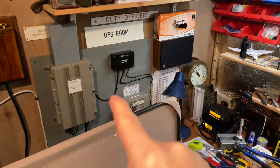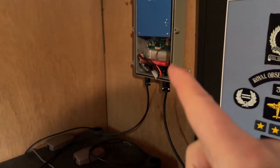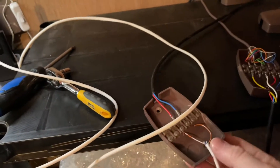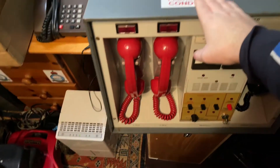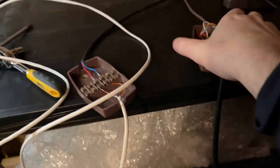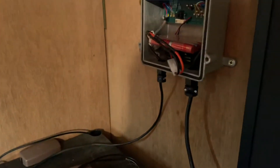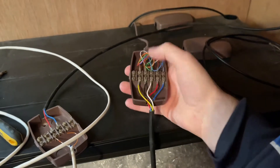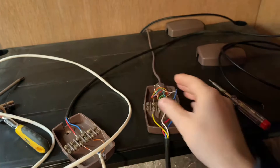What I've done today is put it on a switch so I can switch between the two. I've got this one hooked up at the moment and I've put another box up here — this is a speech receiver, and that is controlling this box. That is the connection from the speech receiver to the carrier control point — that's the wire going into the back of the carrier control point — and then I have a 12 volt PSU powering that. This is the connection between the speech receiver and the speaker, running along the back. That is technically how it would have been wired.